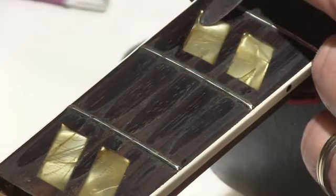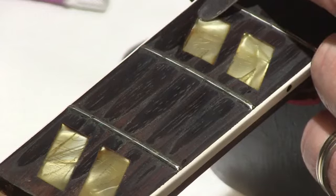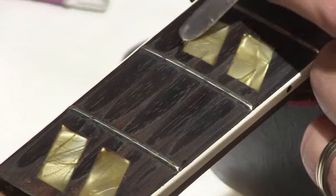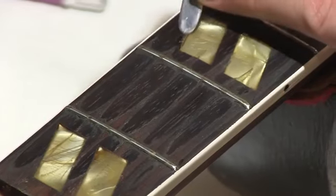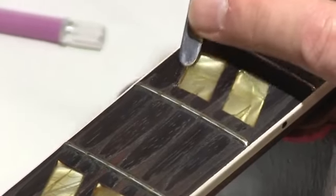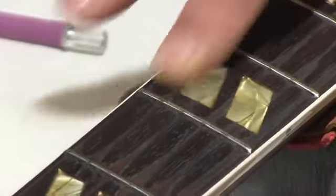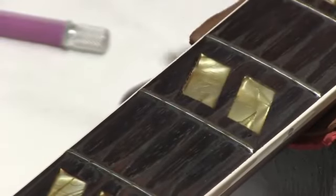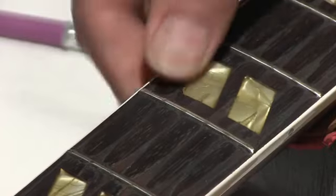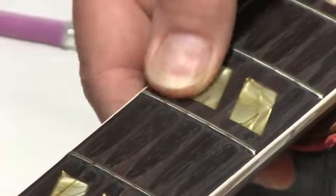And I love it because it sticks to many species of woods, many different materials. And for restorations, doing what I'm doing here, I can make this thing completely invisible and not have all the inlays pop out five years, ten years, whatever, down the road. It's a good process. Like this one right here, I can feel it lifting up. So this one's back in. I had pressed it in earlier, and then just wicking the glue right in there did that.